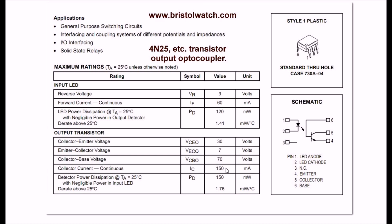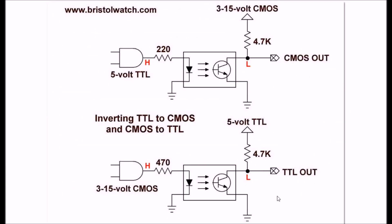Optocouplers are interesting devices. Now let's look at how optocouplers are connected. Optocouplers provide two advantages: they isolate the input voltages from the output voltages, so they work really well for logic-level shifting. You have to get a few concepts in your head as we walk through how these are configured before you use them. Up here I have a TTL gate — TTL is like an Arduino — they put out five volts. In this configuration this is called sourcing the current, because the current moves from the gate through the resistor through the LED to ground.